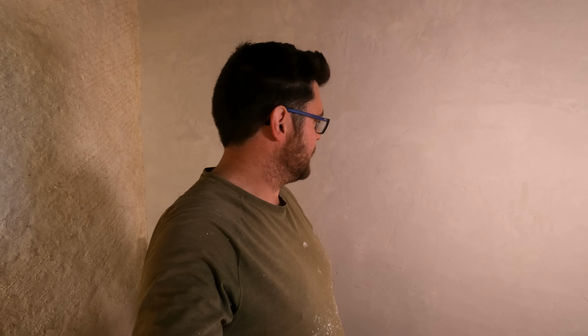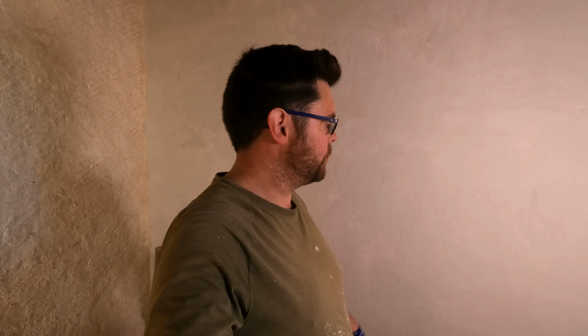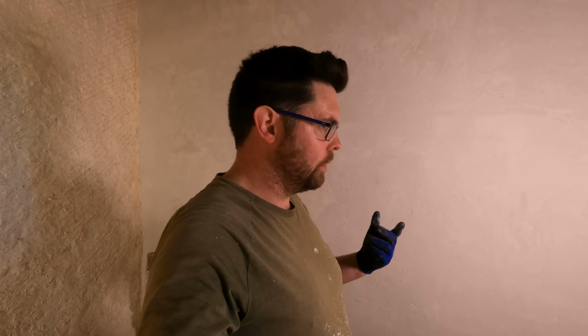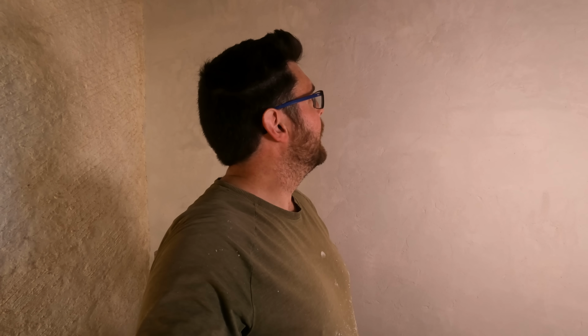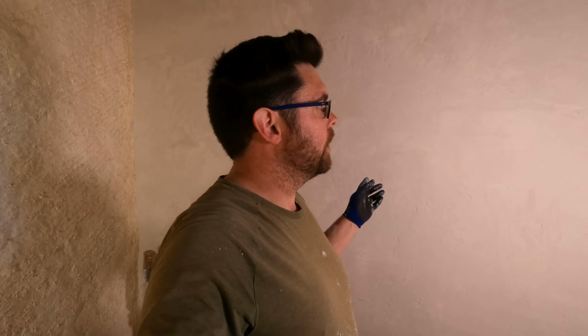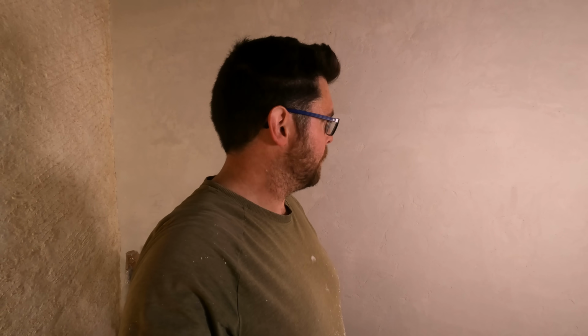So that's the second wall plastered. Very pleased indeed. And I can definitely already, just with a couple of days of this and two walls, feel like I'm improving. I've got more control. I still don't have much control, but I have more control than when I started. And I think this wall has a lot fewer trowel marks and scuff marks and stuff like that. There are still some, but I'm hopeful that the sponge float will get those out. Still need to do the corners with the paintbrush and the water just to tidy those up.